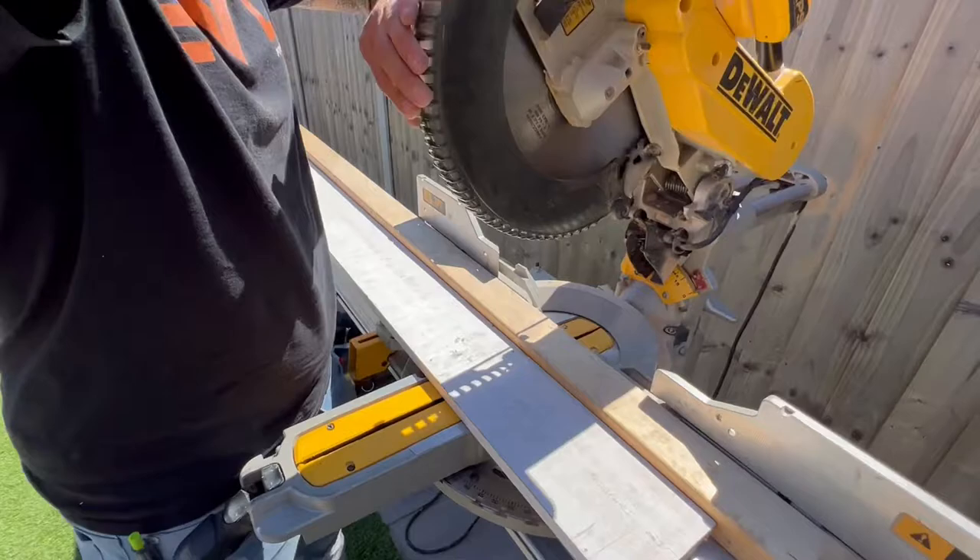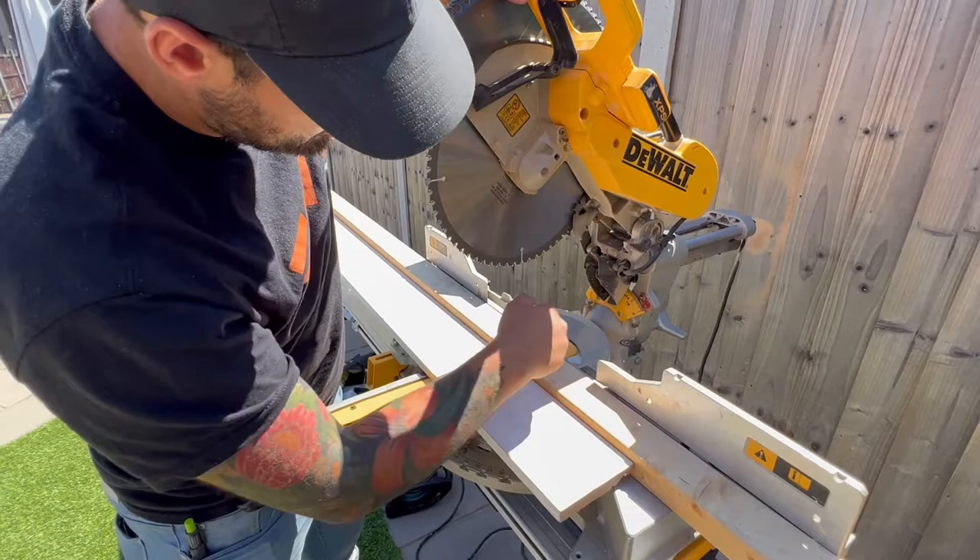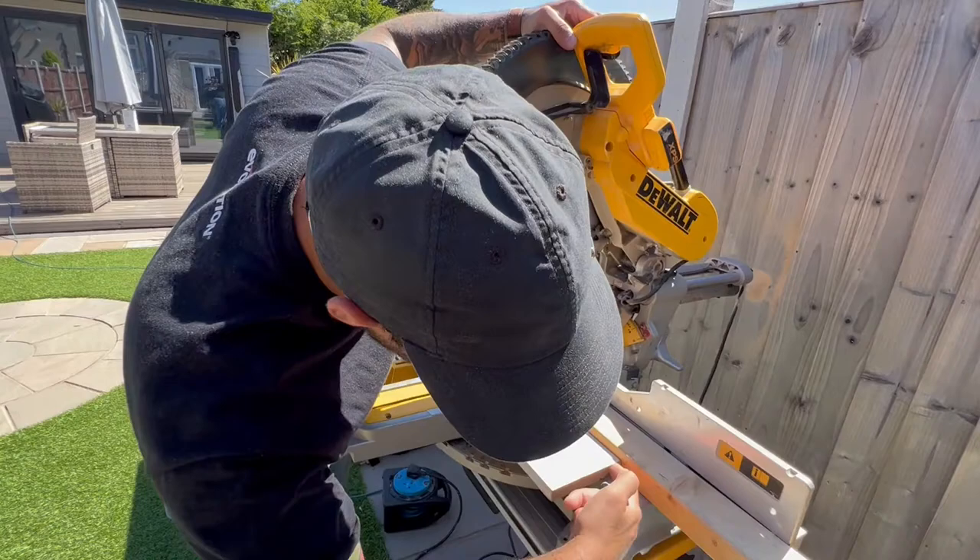Put a little bit of timber across the back — the reason for that is we want full depth all the way through. Saw blades are rounded, so as you come near the fence, without this wood here it wouldn't actually cut full depth on the face; it would only go part way up. We do this so we can get full depth all the way through.